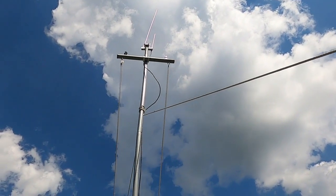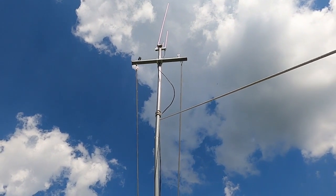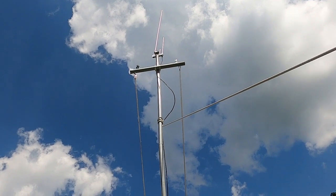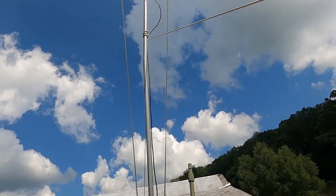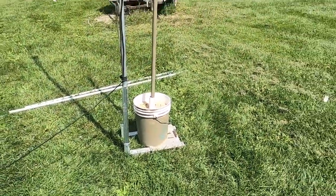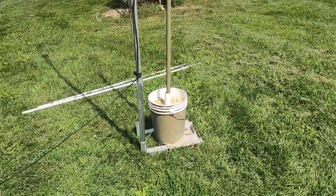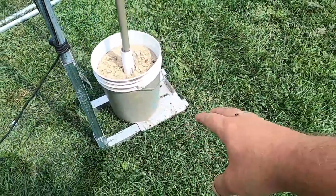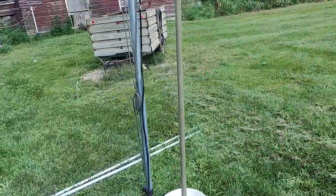There are guy lines on here. You'll see I don't have the bolts on that one because I wanted to keep it as light as possible. So I used a prusik hitch to hitch 2 lines. And really all I need is 2 lines at this point because the base is pretty standard, and in decent weather this holds up fairly well. The platform gives me the ability to drive my car onto that, so I just back my car up onto that. And in pretty calm weather, I can mast without the guy lines.